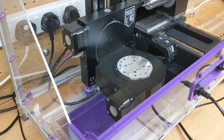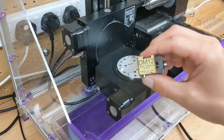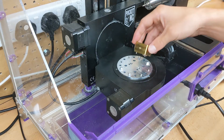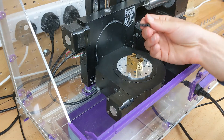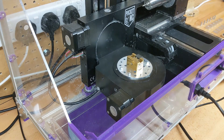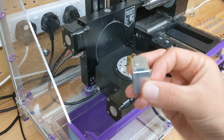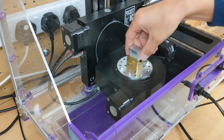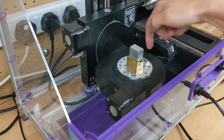To set up the base plate for five-axis work, you get your DM-12 made in the USA by Fifth Axis and line up the two dowel pins with the two holes on the plate. Then use the M5 screws that come with the DM-12, pop those in, tighten them, and that's it. That means you can do your five-axis work with dovetail stock — just pop it in, tighten it from behind, and you can hit five sides all at once.